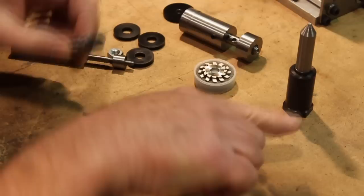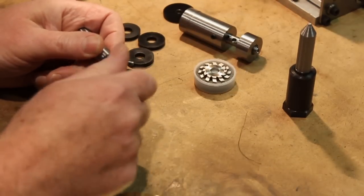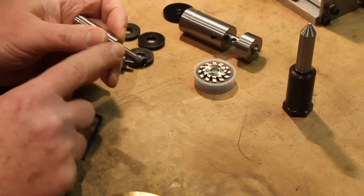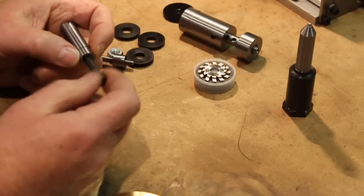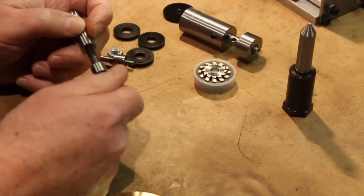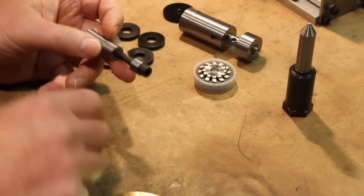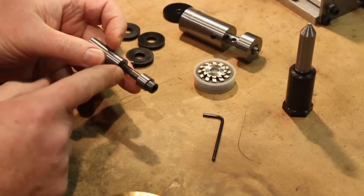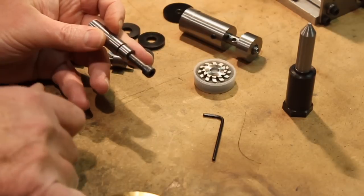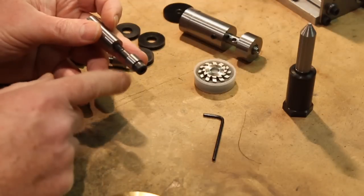For gears with a quarter inch shaft I took a shortcut, because a quarter-twenty bolt or screw has a quarter inch shaft, so this one is a much simpler design. I simply threaded this piece of steel. These were all made of 12L steel, but with this one I can just mount gears with a quarter inch arbor hole and hold as many as I need to on here.